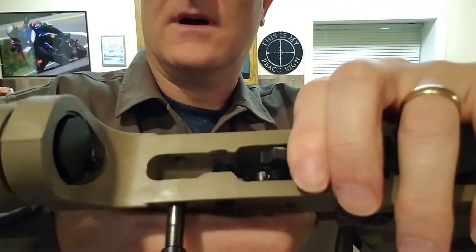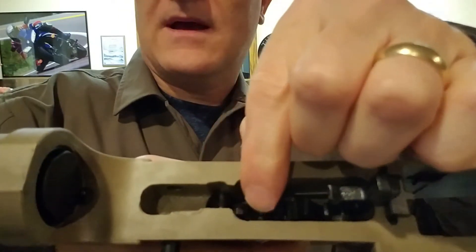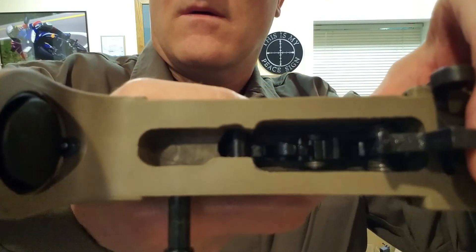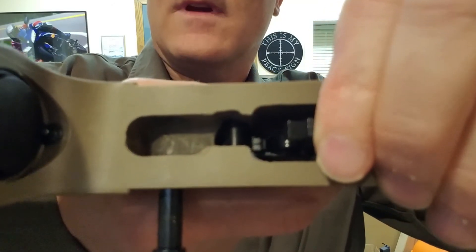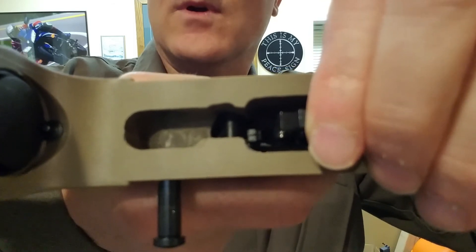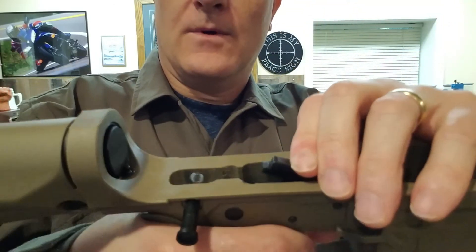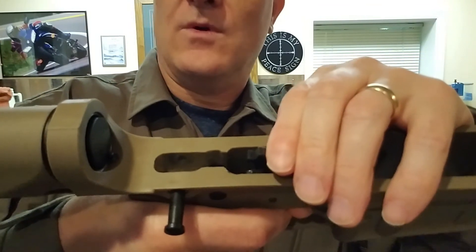But in actual shooting with an upper it doesn't always work. I think the back of the hammer — you can see how that shade changed a little bit because it got deeper — might be riding or touching the right side of where I have milled out. So I'm going to take this fire control group out of here and see if I can make that a little smoother.